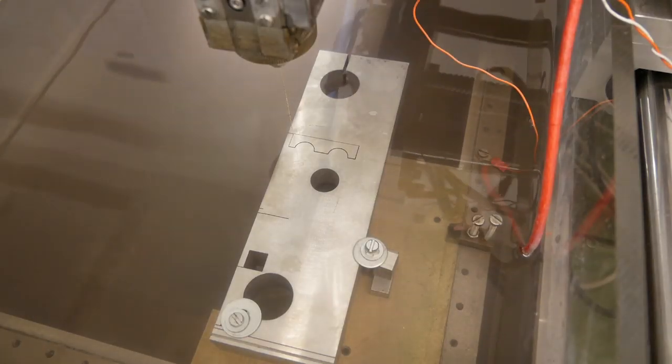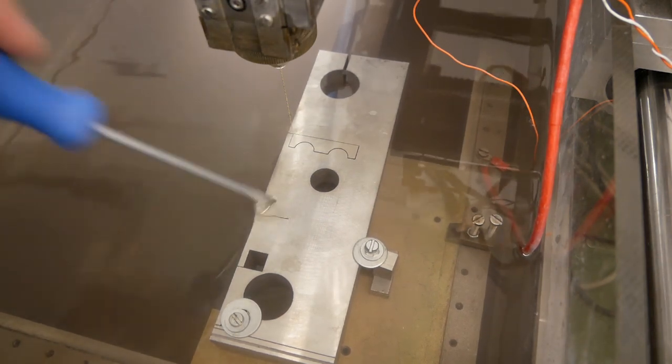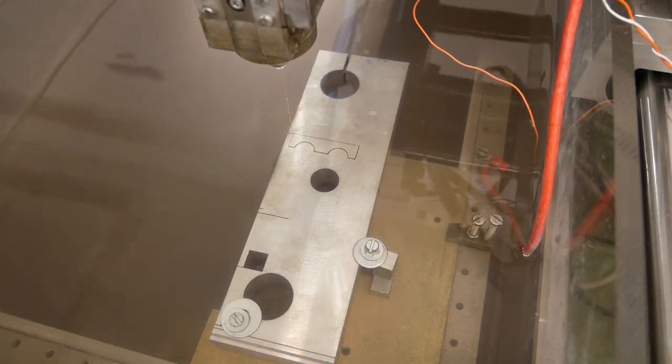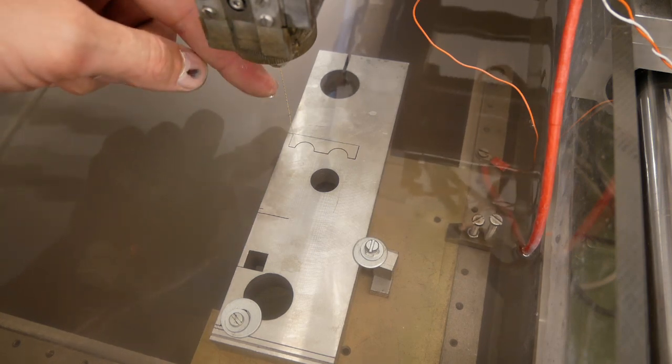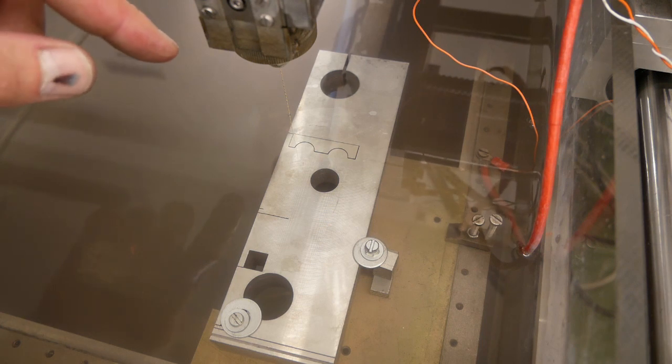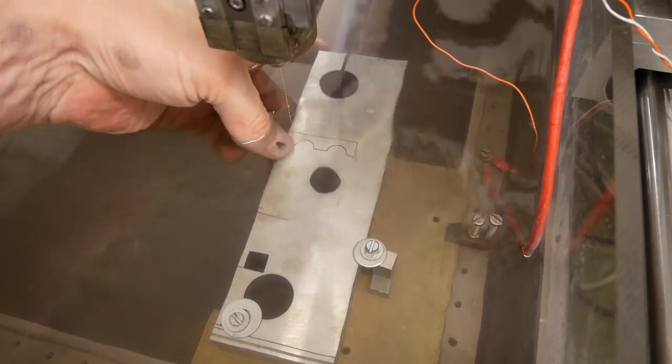I started cutting and then the wire broke — and I know why. The reason was that I ran out of water, so there was not enough water in my reservoir. I use circular vane pumps, and if there's not enough water in the reservoir, you get a whirlpool and the vane pump can draw some air. When air gets into a vane pump they stop sucking, and when there's no suction it cannot make the pressure for the flushing head. Flushing then briefly stops and your wire immediately breaks. So I refilled the water tank with deionized water and started at a new position, and then everything went okay.